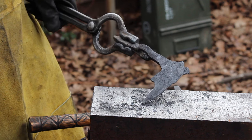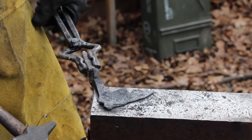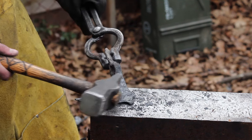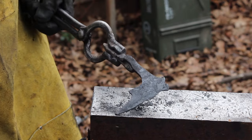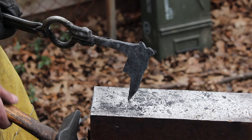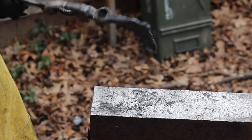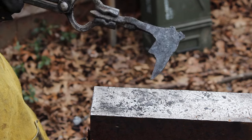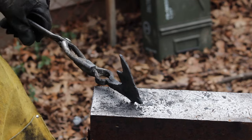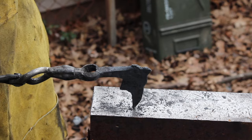That kind of turned into a little bit of a disaster. The blade shifted down a little bit - you can see the end of it right there. I think the forge weld took. I can kind of see the outline of the other spike on this side, but this side definitely looks pretty seamless, so that's good. If I get a little more curve out of this - which I might just grind in - and clean up that nub sticking out, I think it might actually look kind of cool with like a double beard, like a boarding axe. I don't hate it, but it definitely came out differently than I was going for. But that's what I get for showing you guys my first time trying a weld like this.